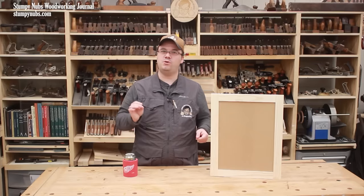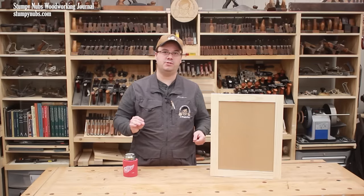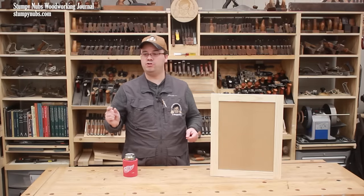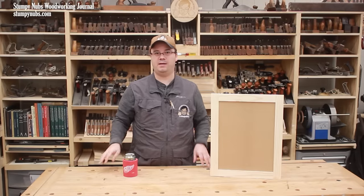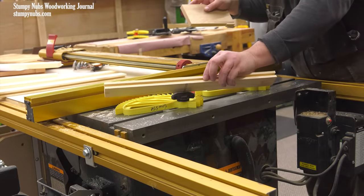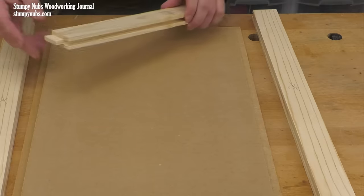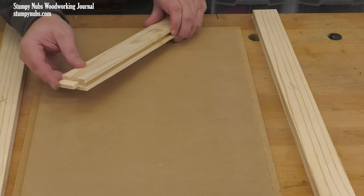We're only shooting for about a quarter inch — it doesn't have to be precisely a quarter inch. Measure how wide the kerf has become, and if it's not yet a quarter inch, make another small fence adjustment and repeat. If you overshoot and your groove is a little wide, that's fine. Once you have your quarter-inch-ish groove in all the workpieces, set the stiles aside — we're going to cut tongues on the ends of the rails now.